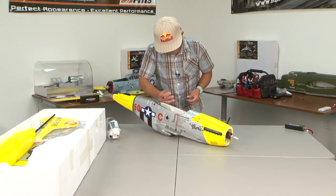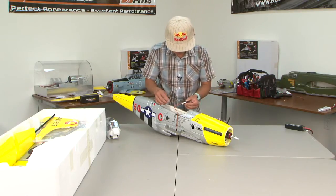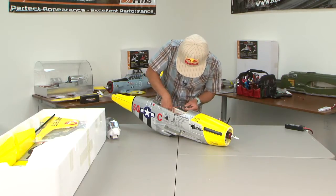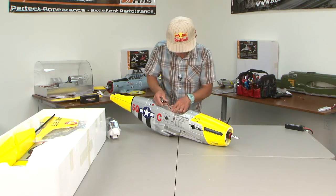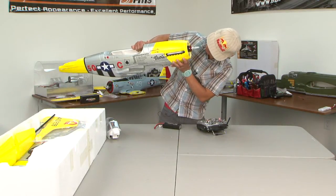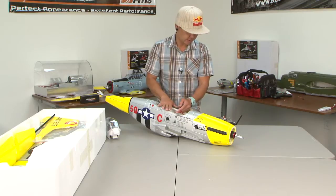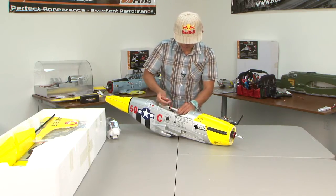Let's go ahead and jump right into this. I'm using a small Park Flyer receiver here just for programming purposes. I'm going to plug in the throttle channel, then plug in an elevator servo and the rudder servo. This is the 1400mm P51 Mustang — it's just so sad to see these airplanes come back. The customer had that exact same issue of no sound. I'm going to plug this in — it's a four-cell — and see if we hear any beeps.